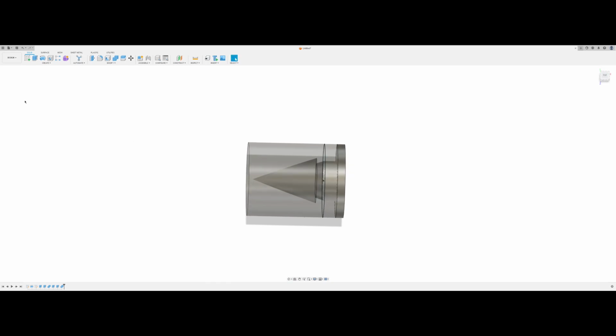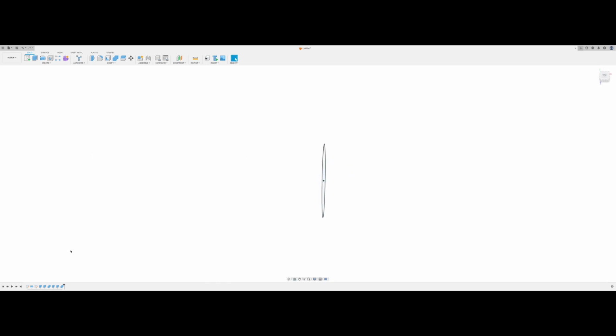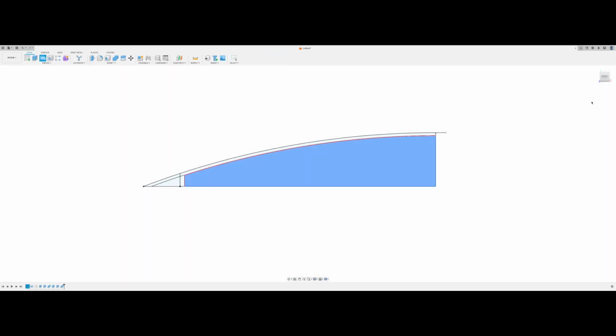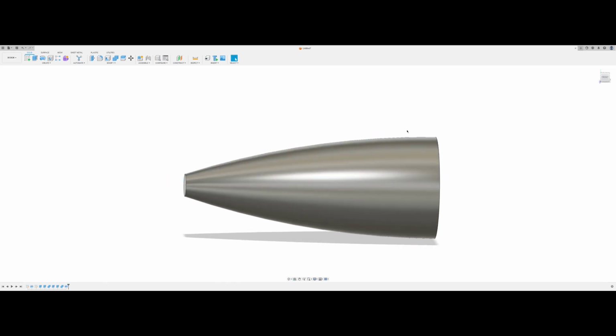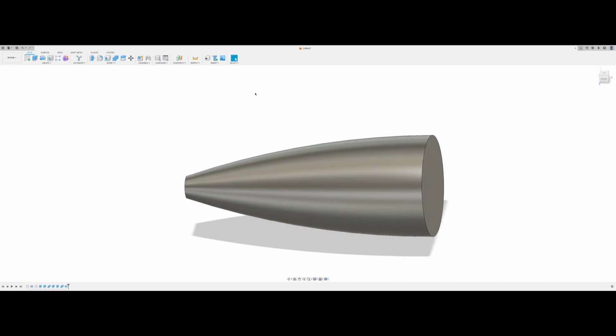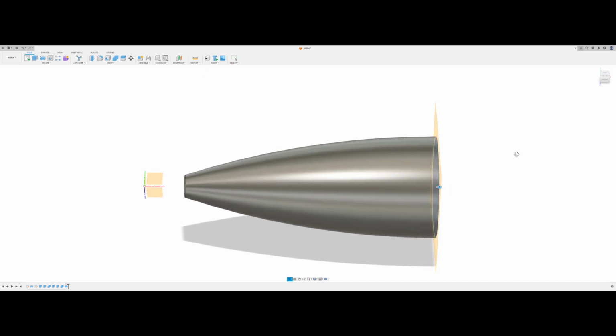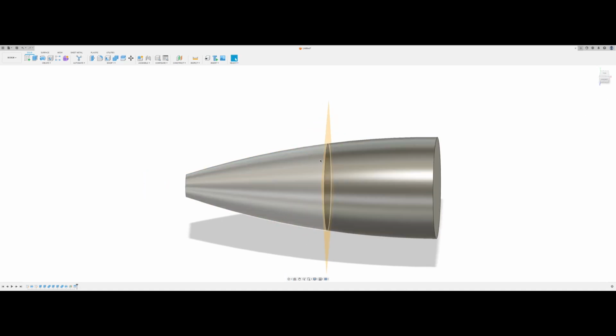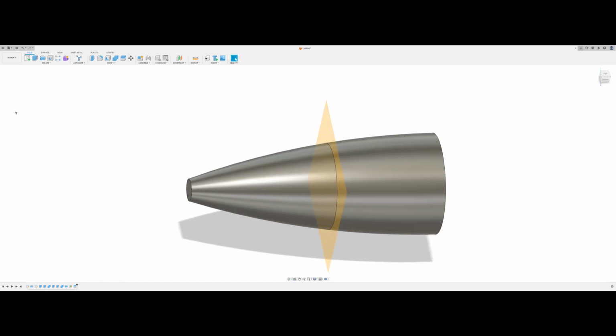Now, moving on to the mandrel for the main body of the nose cone, the process is much the same, though this mold will require some form of surface preparation to allow it to be removed once the part has cured. I would really recommend some sort of a physical separation layer if possible. Balloons work well for oddly shaped parts like this. It is, of course, still possible to do a dissolvable mandrel, which would allow you to make things like a single piece Haack-drawn nose cone using this same technique.